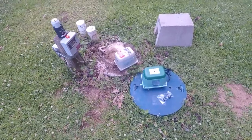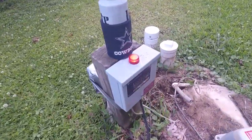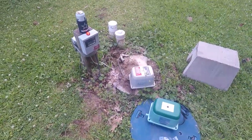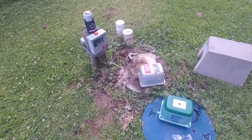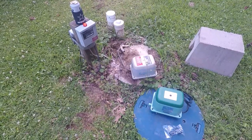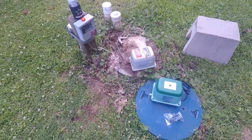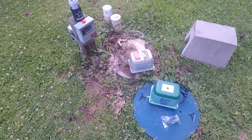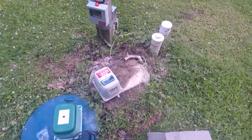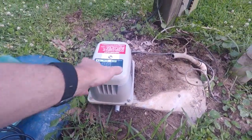Hopefully this will be a quickie. A couple of weeks ago — I've been out of town for a while — the alarm here went off. You can see that little red light. I had my wife disconnect the audible alarm. My air pump died in my septic system. I think I had this done in 2012 or so — the old tank collapsed, so we put in two 900-gallon tanks, an aerator, and it pumps out into the yard. The aerator helps keep the aerobic bacteria happy.